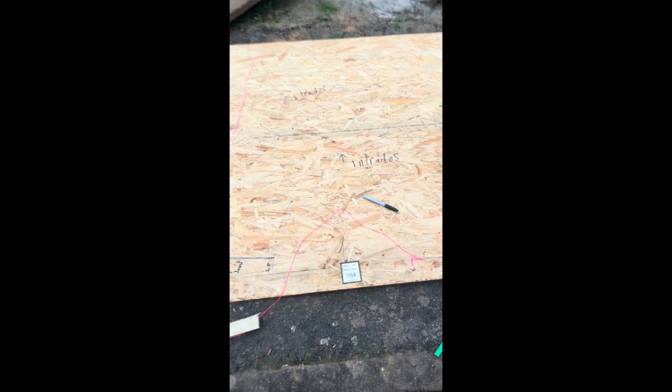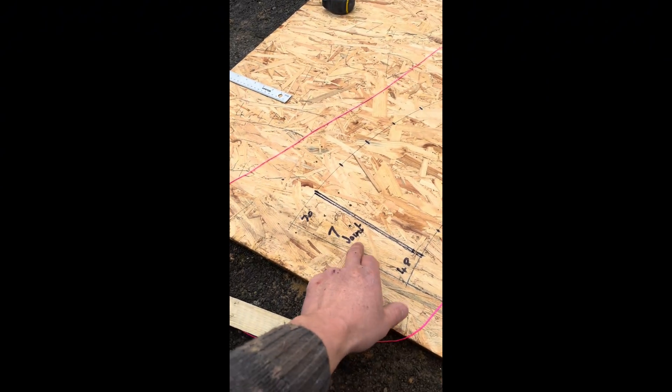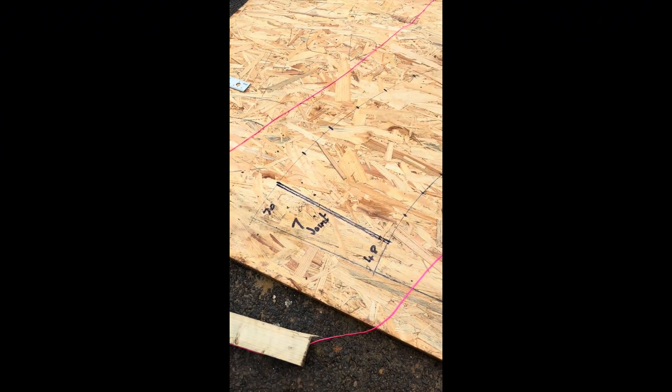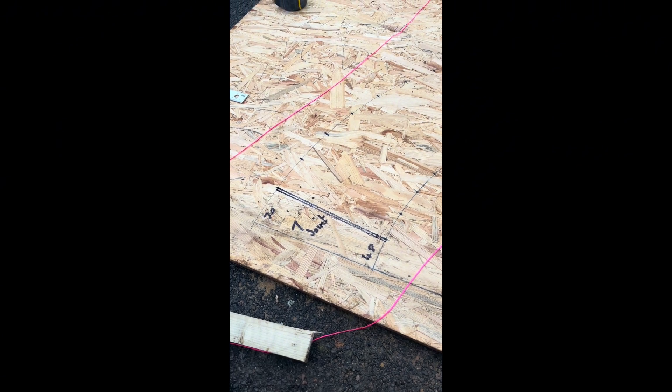Now if you've done all this hard work and you only need the internal part for your arch former, you could just cut that out and use it as a jig. If you cut out the intrados shape, you could put that on the brick to scribe and cut each one. Your work isn't wasted at all — you'd have a template, and it would make life a lot easier.